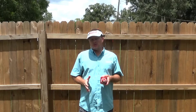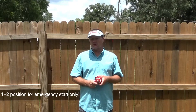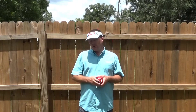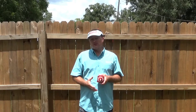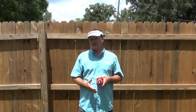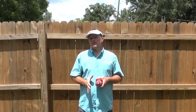This is pretty much it for these battery switches. The only time you're going to use the one plus two position is in an emergency situation where your battery's dead and you can't start your engine — then you can switch to one plus two to combine both banks. Do not run this full time in one plus two when you're using the boat. This could run both batteries dead. If there's an issue on the boat where there's current being drawn, it'll pull both batteries down and you cannot start your engine with either one. Hence the reason for one position and two position — it keeps the two battery banks separated so that you cannot discharge both of them completely dead.